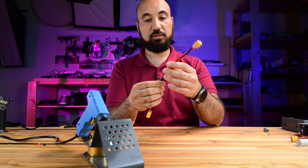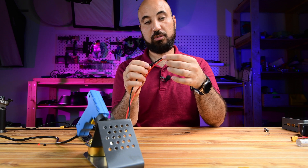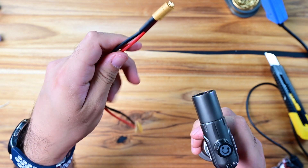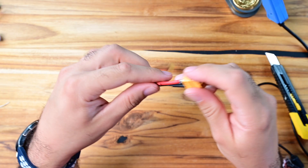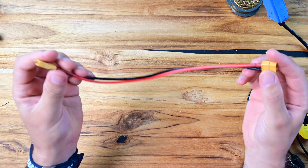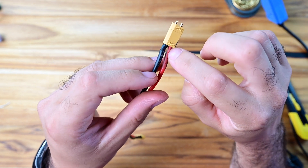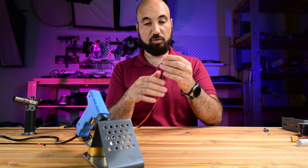We've made the connection - it looks good and will look something like this. Now we move the heat shrink pieces to protect the connections, like this, and heat them a little bit so they shrink. It looks good on the other side too. The wire is done, guys. I overheated it a little but it's not a problem as it's only the plastic. Make sure the solder joints are not touching and are totally protected.